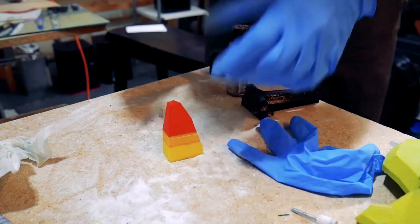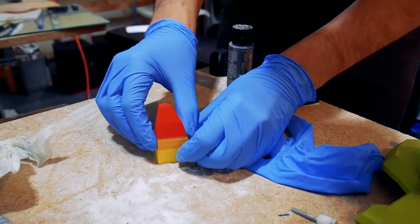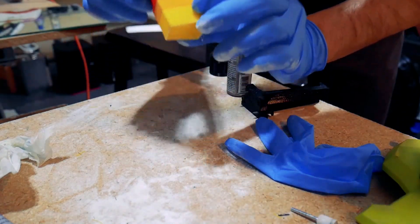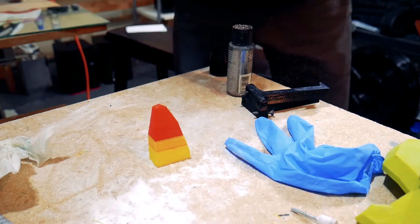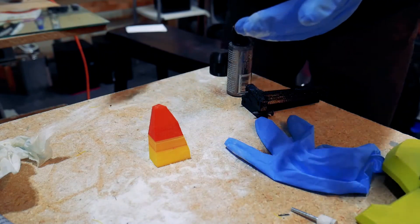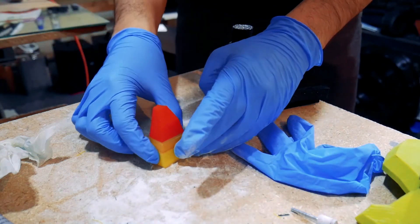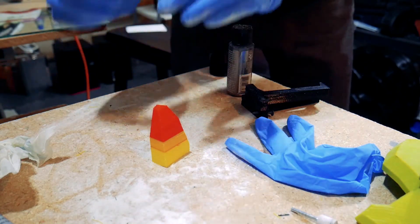Really clever stuff. It pretty much makes two separate pieces into one piece of plastic. Now it's not as strong as a firm weld where you're literally melting plastic together, but it comes pretty close. So definitely as far as gluing goes, it's a really strong way. You want to let that chill and do its thing — usually I found it takes about one to five minutes to completely set and harden. And word of warning: make sure your alignment is good and make adjustments as quickly as possible, because once it's set, that sucker ain't going to break.